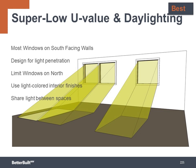North-facing windows collect very little solar heat, so they're used really only for lighting. You should design the smallest area of windows facing to the north when possible. Other design strategies would be to have rooms that are the least used, like closets, storage areas, or even garages, placed along the north wall where they can act as a buffer between the high-use living space and the cold north side.